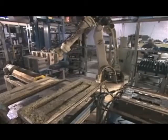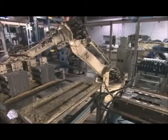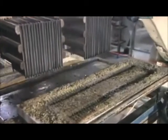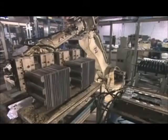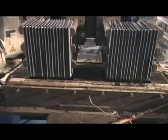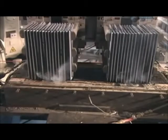Each plate has a tab. A robotic machine cleans the tabs with a wire brush and a chemical solution called flux, then dips the tabs in molten tin. This tin coating will improve the bond when they solder the tabs together. The robot wipes the tabs on a flux-imbued sponge to clean their surface once again, then drops the cells into a mould containing molten lead, which solders the tabs together, bonding the plates within each cell.